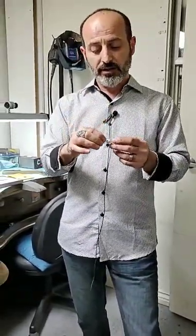We're going to show you guys how we're going to do the final polishing and assembly, the bale assembly. We're going to use the laser machine to weld the silver together, and afterwards we're going to do cleaning and we're going to do rhodium plating. So we decided we're going to do black rhodium, which is grayish gun color black rhodium. It's going to suit this piece very well. So this is what we're going to do.